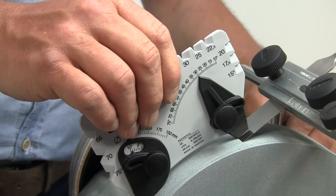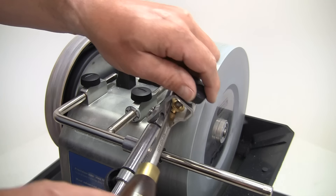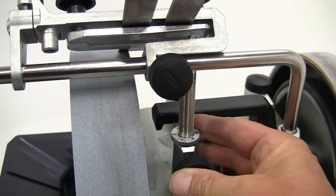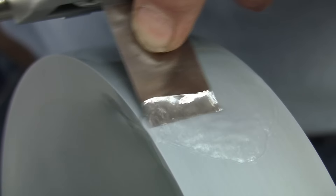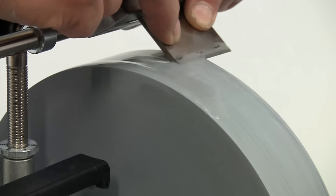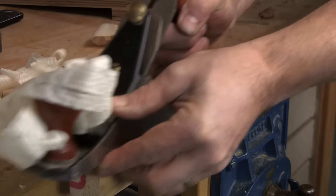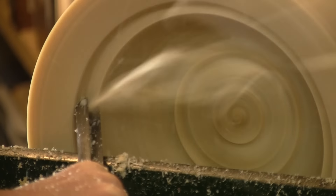If you want a new or a specific angle, use the Angle Master. And for turning tools, see the specific videos. The precise angle setting of the jig ensures minimal steel removal, and this is what makes the Tormek method so fast. In reality, you're only removing fractions of a millimetre of steel to leave tools with a razor sharp edge that will also last very much longer — not to mention the pleasure of actually using such sharp tools.